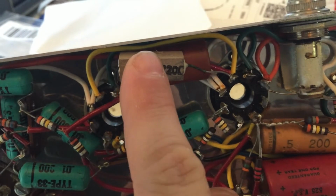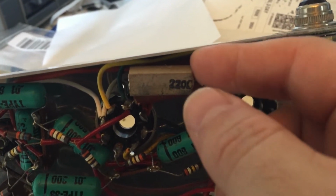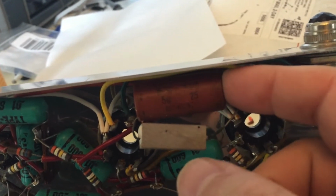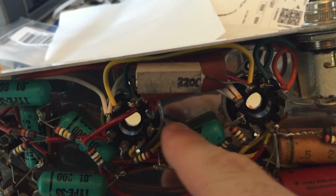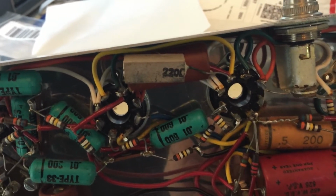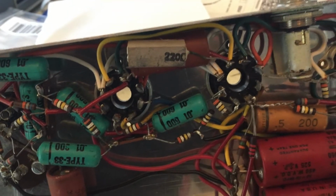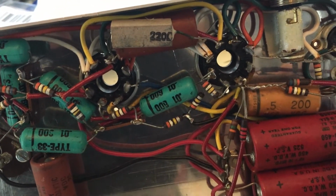You can imagine that this thing must get so hot and sit there, because this is the bottom of the unit. So this sits here roasting right under this chemically treated electrolytic capacitor for all these years, just heating that thing up. So we're definitely going to have to find a different solution. Probably the new capacitor will sit along here, and this will sit up in the tray somewhere, so the capacitor won't be affected by the heat of that resistor right there. I'll look out for other voltage dropping resistors like that, to ensure that that doesn't happen again either.